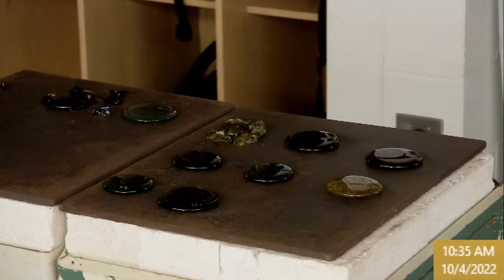But on that one, it's the split second timing. A bad day at the bottle factory would have to be just mayhem, blobs of glass flying everywhere. But they've got this equipment timed so that as the next blob is falling through the air toward the bottle former, this one is finishing the process. It removes the finished bottle, the mold comes back together, and it slams that next piece of glass in. There's no room for error in that one. But this will be about 10 or 15 minutes worth.